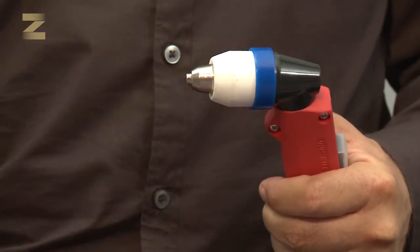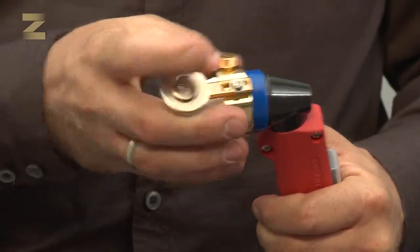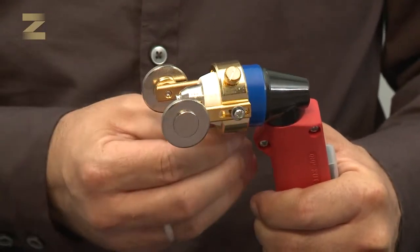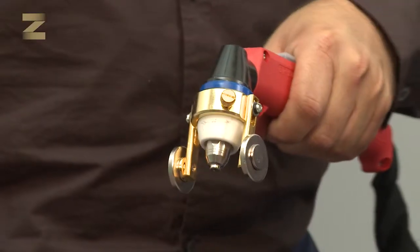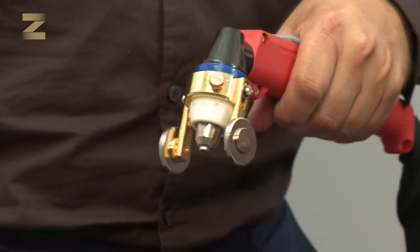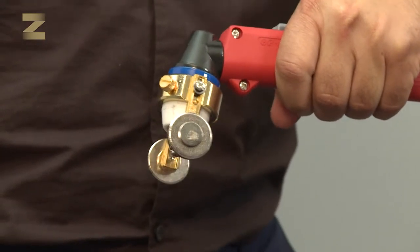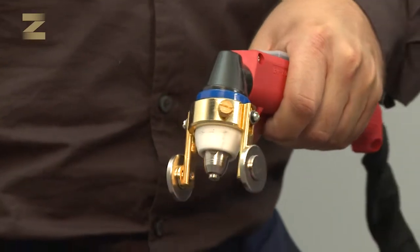Plasma machines of these models feature a pilot arc. During the cutting operation, you do not need to contact the material to form the arc. It is recommended to use the handle roll guider that is supplied with a kit. If you do not use the handle roll guider, make sure not to make contact between the contact tip and cutting surface to prevent causing damage to the contact tip.